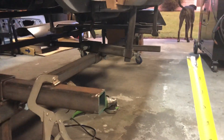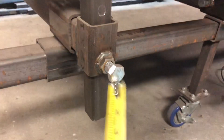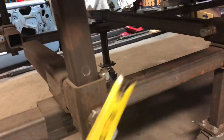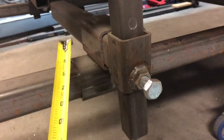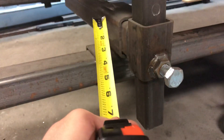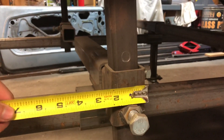There are about 14 sliders per side on mine, and you might need more depending on how many braces you have. So: 2-inch beams, 2-and-a-half-inch slider arms. The main slider arms are 2 inch, and I went smaller — inch and a half — on the verticals since I didn't need the extra size. The 2-and-a-half slides over the 2-inch, and the inch-and-a-half slides into the 2-inch.